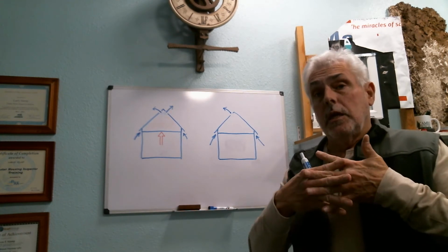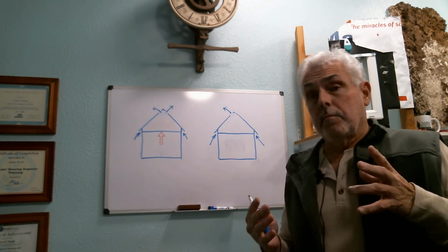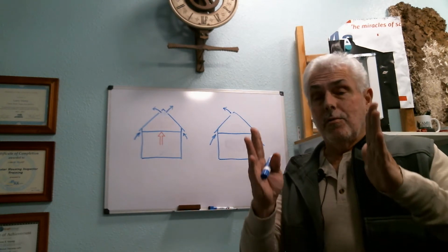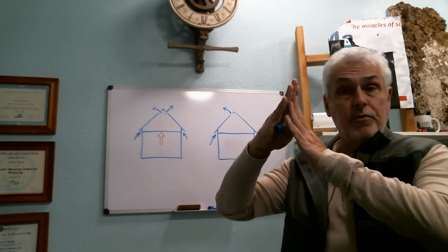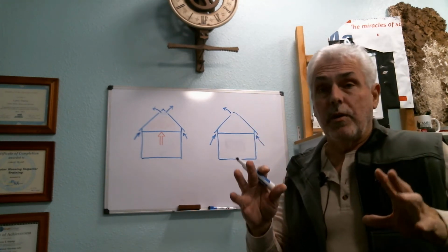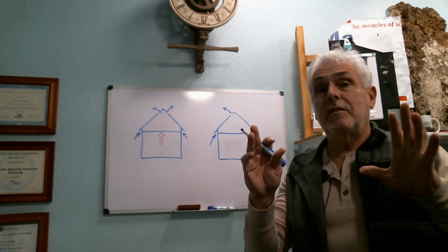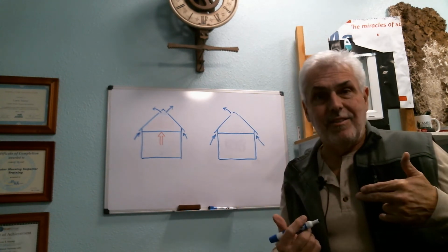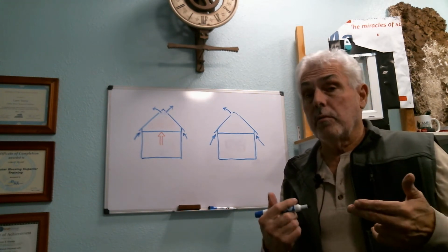Last week in our episode about attic mold, if you watched that, you would have learned that attic mold primarily is a heat loss issue. Just as a refresher, hot air rises, takes moisture with it, and when it gets to the attic, it hits the underside of the roof sheeting, it condenses, and it grows furry stuff, black discoloration, mold. Okay, we agreed before we're just going to call a spade a spade. So it's mold. But let's talk a little bit more about some of the issues that are contributing to this happening, and primarily this whole issue of moisture and moisture control.